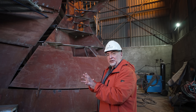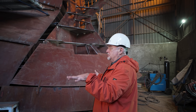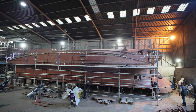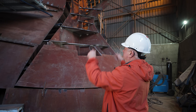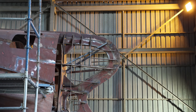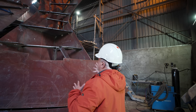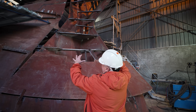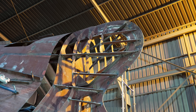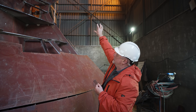Most of the boats, especially smaller boats, they get constructed upside down. So instead of laying the keel, we lay in the deck and then the boat starts to get built up. This is the bulbous bow — you can see how much reinforcement it has. We have 30 millimeter keel, all connected and reinforced by stringers and frames. In some cases we put special concrete in this bulbous bow.